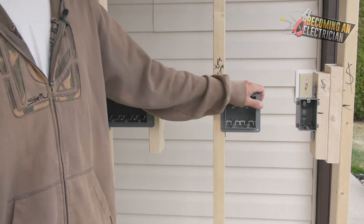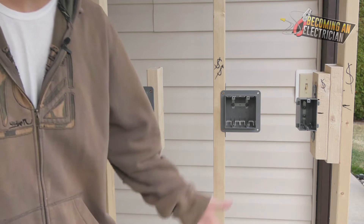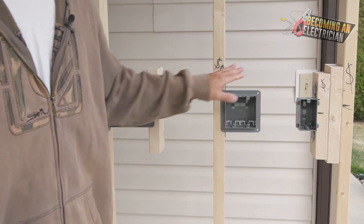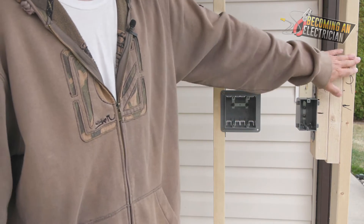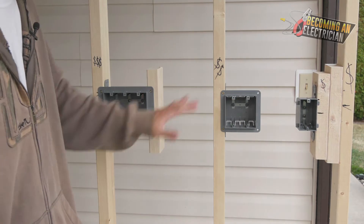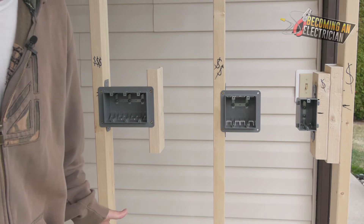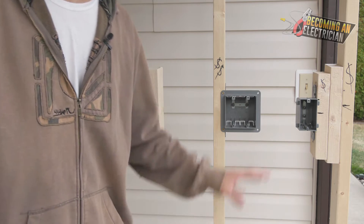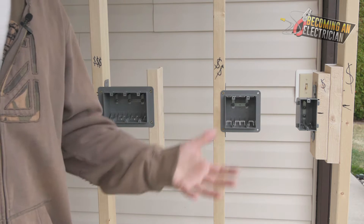When it comes to drilling, the first thing to understand is the circuitry. You want to be thinking about power — where does power come from, and what box is power actually going to? The person who's marking out sometimes would say we want power right here, and then from there we would jump everything off of there. Understanding the circuit is really important before you start drilling — that's the number one thing. You look around at all the different boxes, plugs, switches, and lights, and figure out what the circuits are.